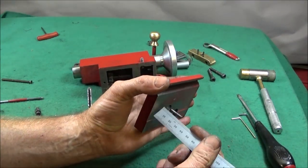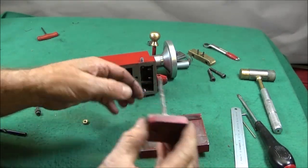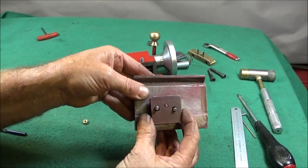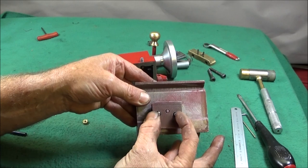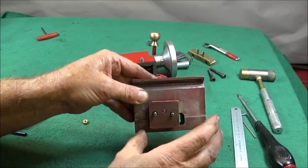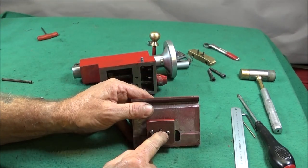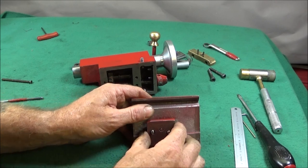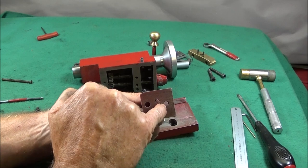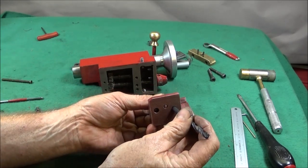That's what it looks like with the 2BA studs in the base — I have them protruding by about 20mm. When the t-nut assembly feeds up through, it's a nice loose fit on those studs so that when you are tightening or pulling the lever over and that pulls up, it's not going to bind anywhere on those threads. Those clearance holes in the t-nut I drilled to 6mm.